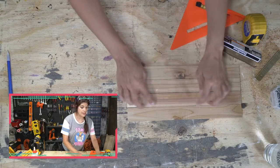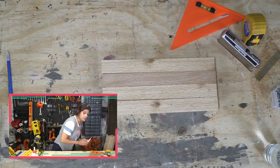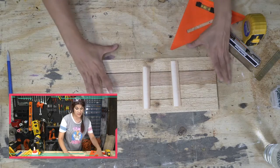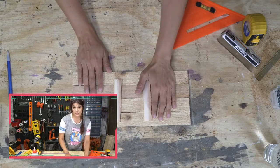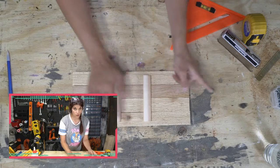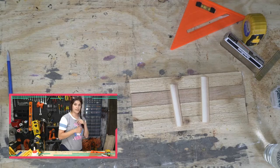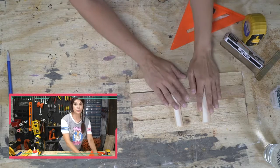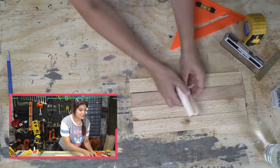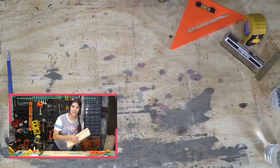So I'm going to go ahead and glue this exactly as we did. And then I cut up little strips as well. Of course, the bottoms don't matter because this is just going to go into that frame. Then what I'll do is drill a pocket hole and attach this in that hole via the pocket holes. Now, got some wood chips going on. Of course, I'm going to do this before putting in the drawer, because then I'm going to have all kinds of clearance issues trying to get this thing in. So, same deal, you guys already saw that. I'll go ahead and rock this out on my own.